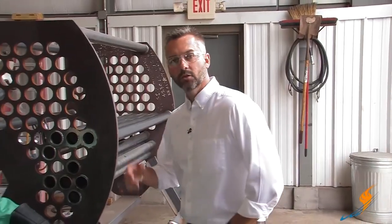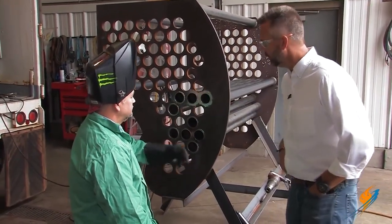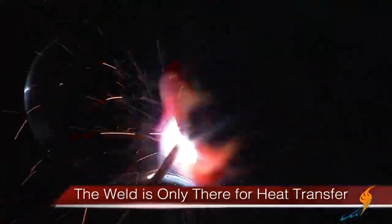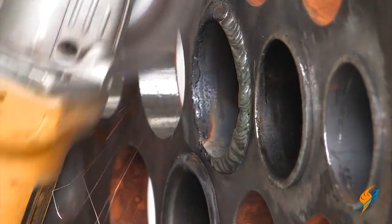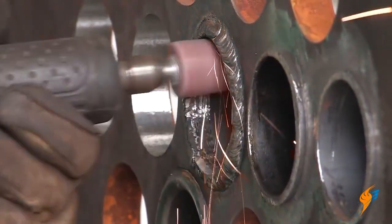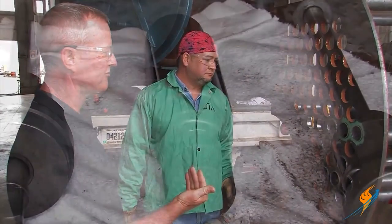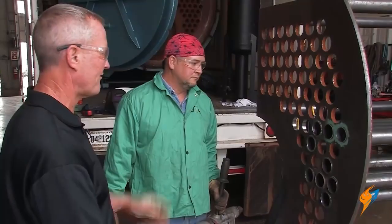Now the tube has been rolled, so we're going to go ahead and weld it. After welding, Jimmy takes a pencil grinder to clean the inside of the tube so that when he re-rolls, he doesn't get any weld splatter in the rolls themselves. Then he re-rolls the tube to tighten it up after welding, using a Collins roll — a different style that doesn't flare, just does a straight roll.